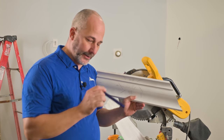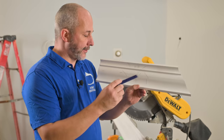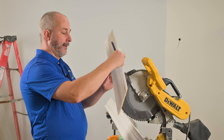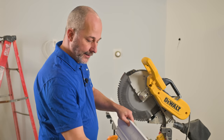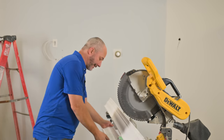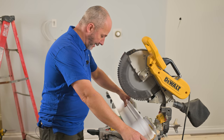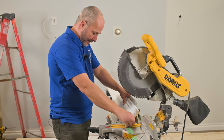The secret to doing crown molding on a chop saw is remembering everything's upside down. The reason I wrote down my number and the kind of angle that I'm cutting is because when I come over to the saw, my trim is upside down. So I take this upside down and the 48 that I'm cutting — now I know what my corners look like. I'm just going to put a little pencil line on it so I don't get confused, because it does not take much to get confused, especially when the phone rings and the wife calls out and the dog barks and the doorbell rings and you're halfway through setting up your cut.